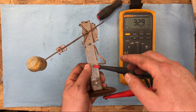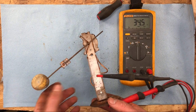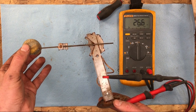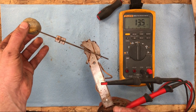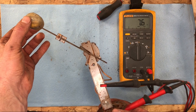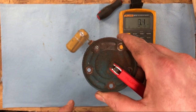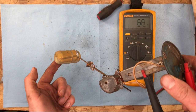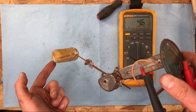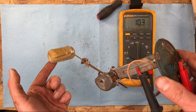Okay. Now that we know that it beeps, let's turn that off. So if we vary it, yep, there we go. So the lowest point, I guess, when the tank would be empty, because imagine this guy's up at the top, so this is when it's totally at the bottom. We're at 4 point something ohms. And very sensitive.